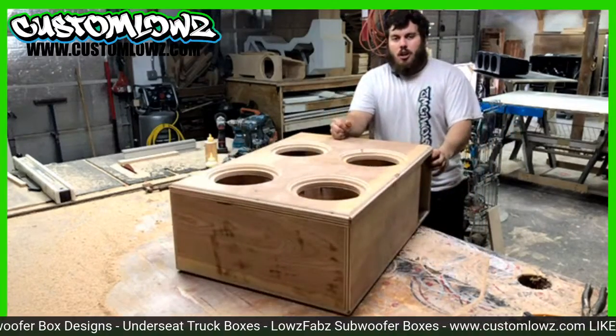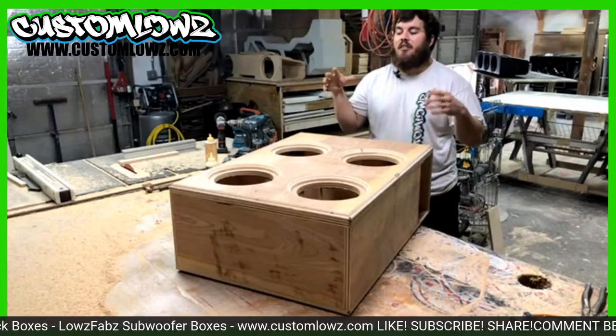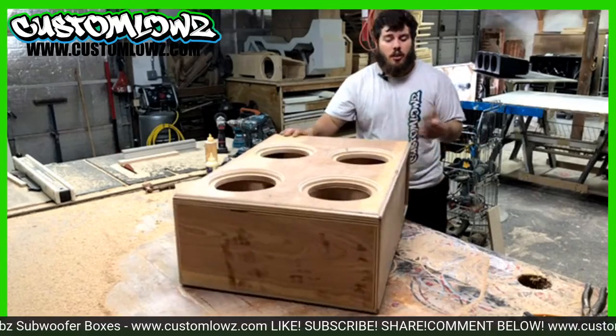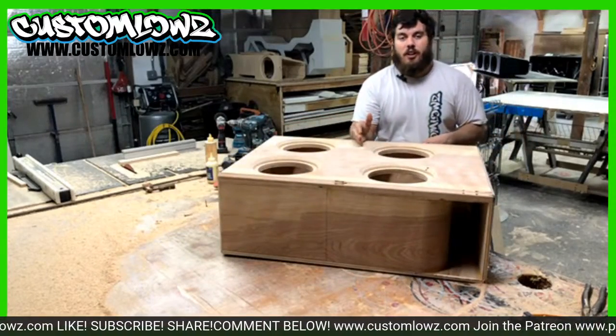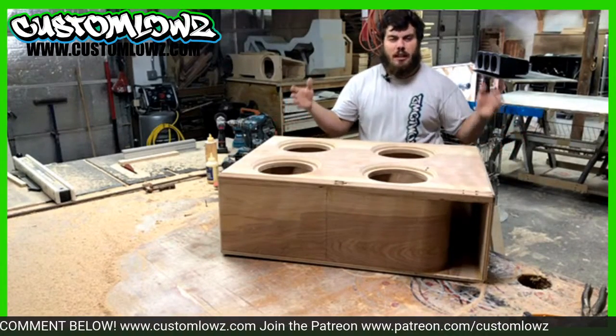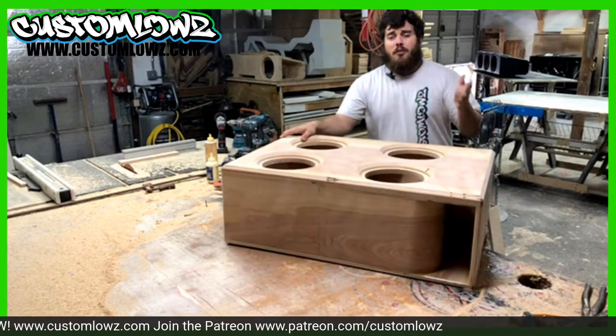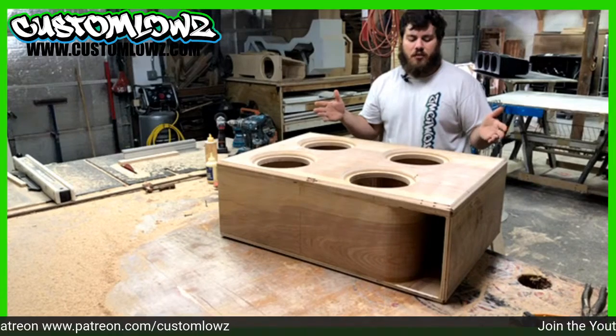This thing is definitely a really strong enclosure. Got a double baffle, flush mount for the woofers. Got the window bracing on the inside. We got 45s in the corner as well. The Kerf port definitely looking good on this thing. We got a lot more work to go. This thing's going to get a bed liner finish on the outside. We got some sanding, wood filling, all that good stuff still left. And then we're going to jump onto the bed liner. We're definitely going to break this down into a third part of the series. So this is going to be it for this much.